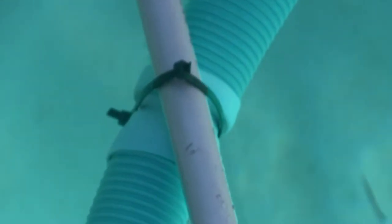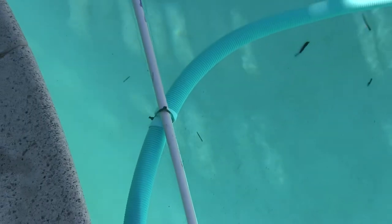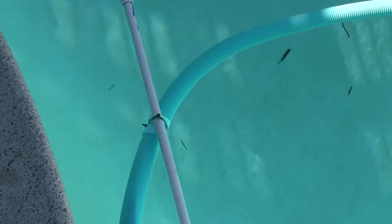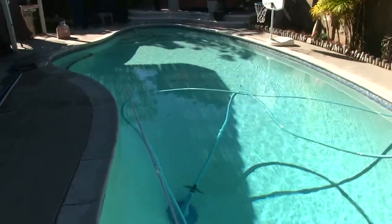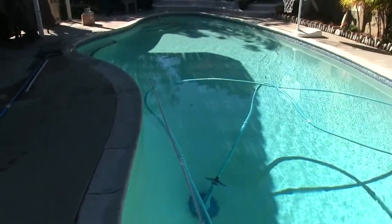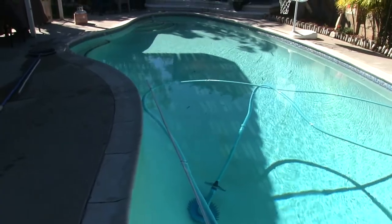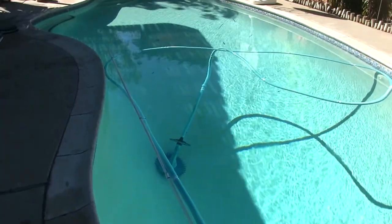This one I made a little bit looser to allow the hose to flex left and right and conceptually get back to the skimmer end of the pool, because you want the pool cleaner to cover everything. The idea is that we're simulating the pool sweep being attached in the middle of the pool rather than the very end — the deep section of the pool.